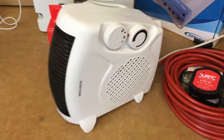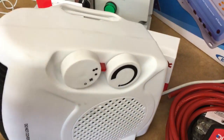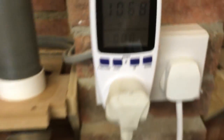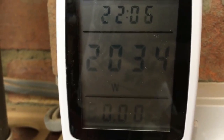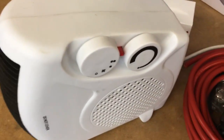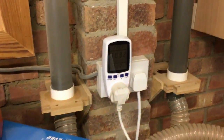I've just plugged in this little electric heater. It's got two heat settings — I've got it on fan only at the moment and we can see that's pulling 30 watts. Let's flick on one of the elements — that's now giving out a nice bit of heat and we can see it shot up to 1068 watts, just over one kilowatt. And if we stick on the last element — yeah, that's nice and hot now — we can see it shot up to 2034 watts, just over two kilowatts. So that initial rating plate saying 1.8 kilowatts is actually drawing just over two kilowatts.